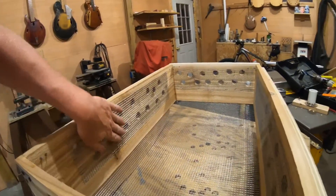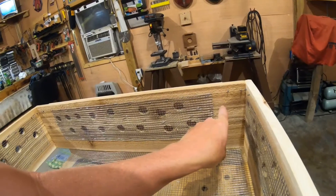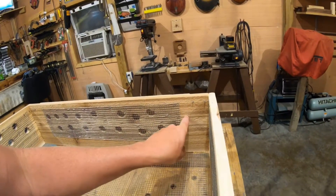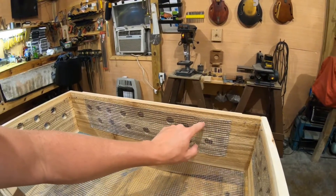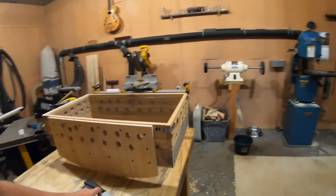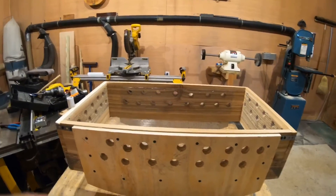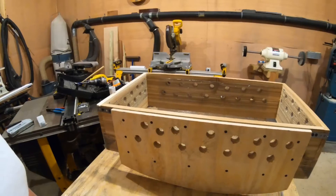We got all our screen stapled on the inside all the way around covering all the holes. I thought about just drilling three-eighths-inch holes all over it like Swiss cheese, but I think the sand trying to get through a small hole through that much wood would clog up. This is better - larger one-inch holes with screen in front of them. I'm not going to be able to bend that two-inch conduit as much as I'd like, so I'm just going to go back to the yellow polyethylene pipe since I have a piece that already has a natural memory curve from the roll.